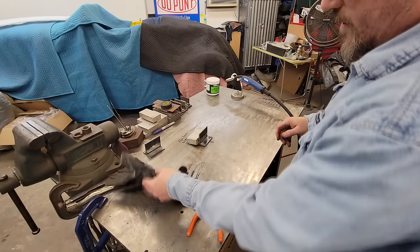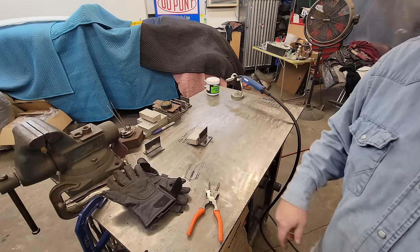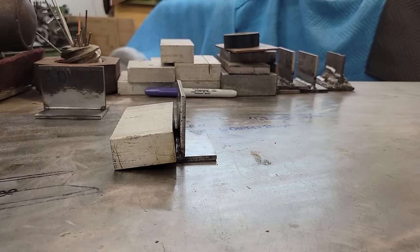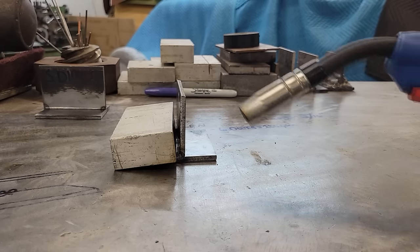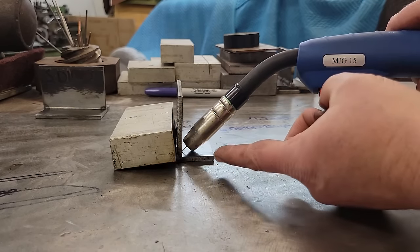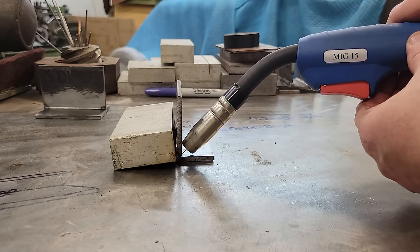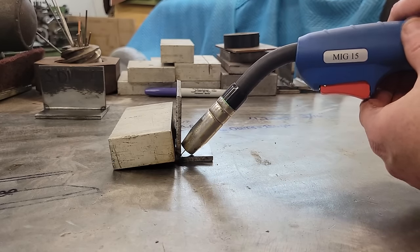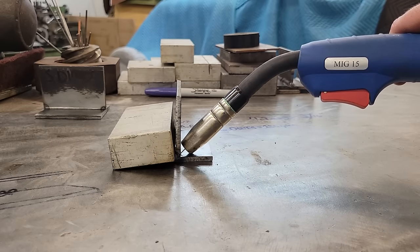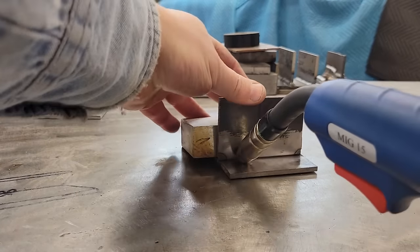So, let me get you in here and show you the angles real quick. All right, guys, first we're gonna start with the angle that it's gonna be coming in from the side and see how this is running in. If you come off of here and come straight up this, that's a 45 or pretty close to it. So that's the angle you want to be pointing in this direction. There's two angles. We're gonna call it compound angle in here. So that's your 45, you're gonna keep that 45.